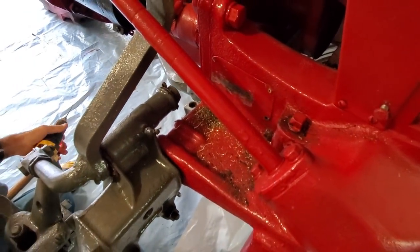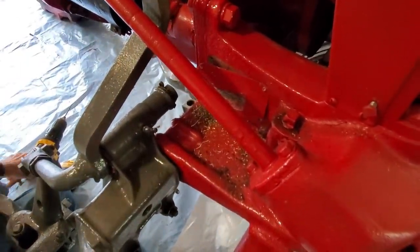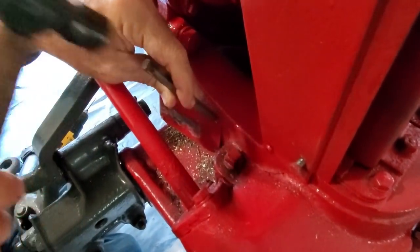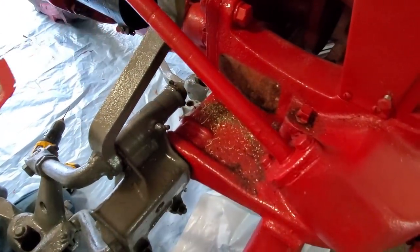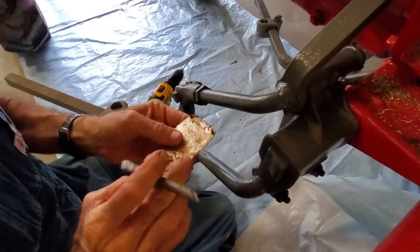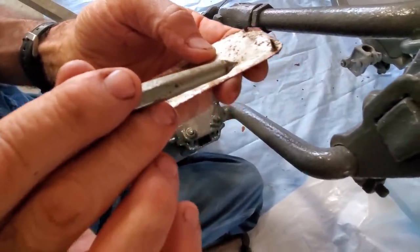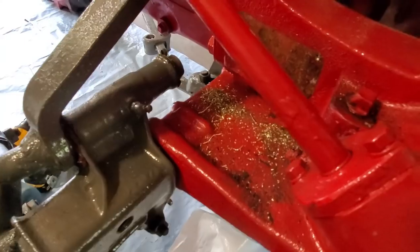What I'm going to do is see if I can go ahead and take that plate off. I've got the plate, but I haven't got the pin out. Parts of the pin actually came out with the plate, so that tells me we're probably pretty close on our hole size. I'll have to get a light and look up in there, but we're going to have to try to get that one out.